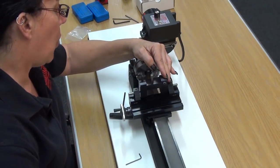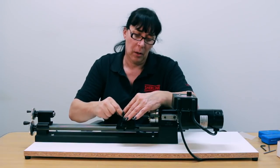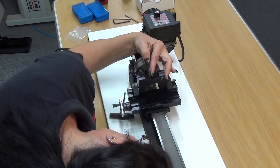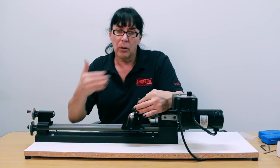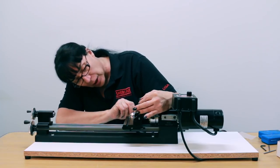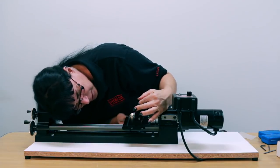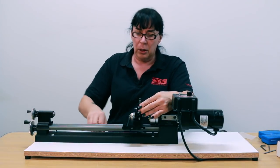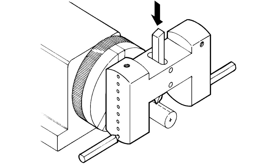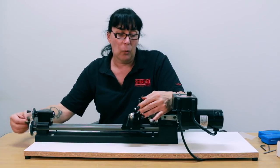The way you set the depth is to roll it forward. Loosen your tool bit so you can move it, and kind of hold it so it doesn't drop. This also allows you to center the face of your tool bit on your workpiece. I just eyeball the top edge of the cutter to the centerline of your part. Hold the tool holder vertical, pushing down on your tool bit to lock it in place. Now this sets your radius reference. Keep it vertical and walk it away from your part.